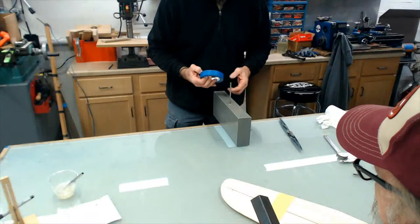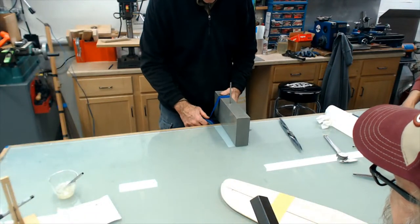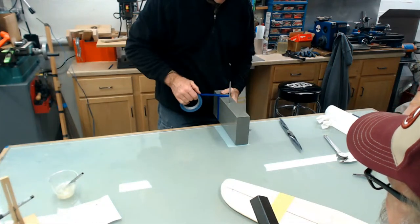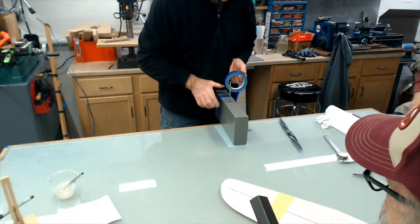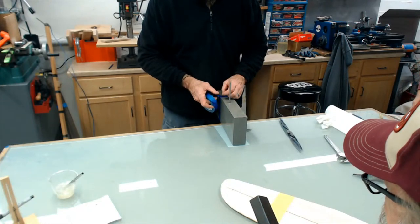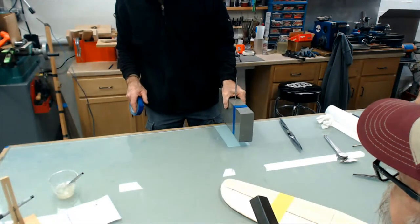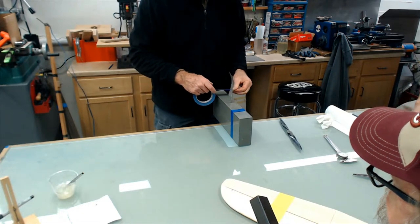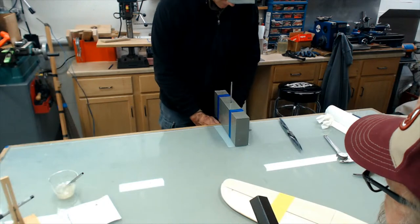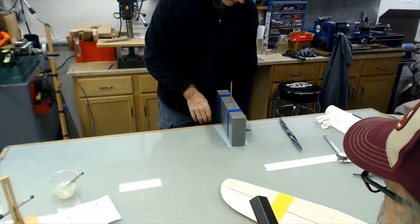The other thing, if you're building another airplane, you say, well, I need a tank, but I need it this size. If you can control the size of the tank and have options for different sizes, I don't see why you can't make it out of fiberglass. You're not saving that much difference in weight. Not really, especially if you use an S-glass or one of these high-performance glasses. For something like that, the strength isn't all that important anyway.